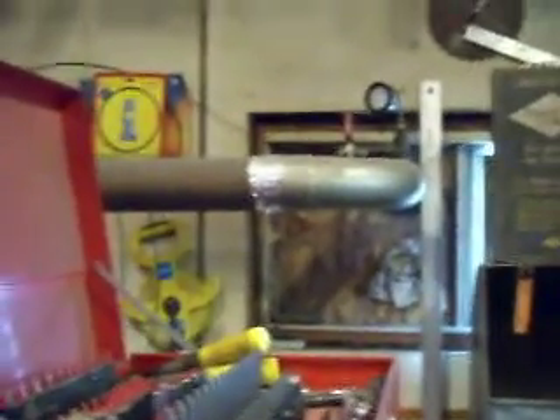A lot of you might recognize the rest of this as the heating system. That's the exhaust pipe — it's actually semi-exhaust pipe — and it simply goes outside. There's a gauge up there that measures the inches of water column suction on the system. Outside there's a central vac blower motor — not a shop vac, a central vac. I've just opened up the window and there's a thimble in the wood in case it gets hot, but when running at full temperature I can actually put my hand on that exhaust pipe and hold it there for quite a while — it's not that hot.